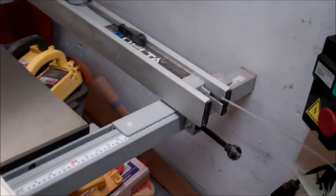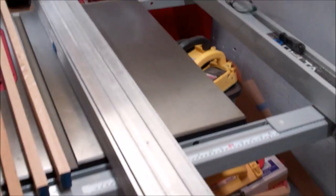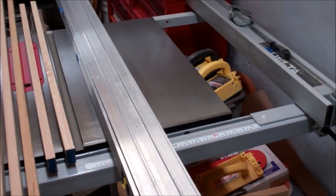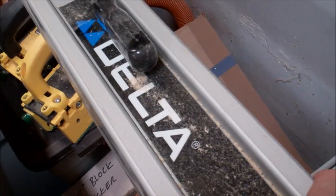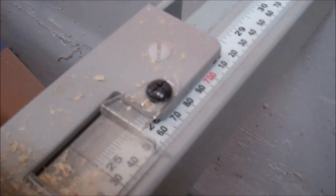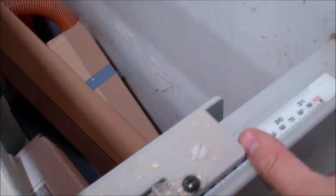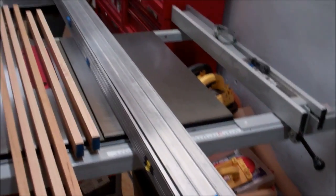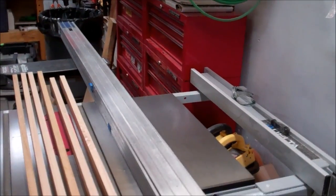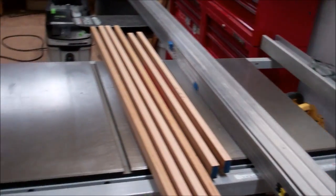The fence sticks out more than halfway through the shop. I've come to the resolution that I'm going to cut these rails so I can bring it tighter to the wall — something Matthew Teague discussed in an old Fine Woodworking article about a one-car garage shop. I think I'll probably go to about 25 inches, gain maybe five or six inches, and bring the saw over. I've got a track saw if I really need wider capacity, and I can't tell you the last time I tried to rip 24 inches on the table saw.